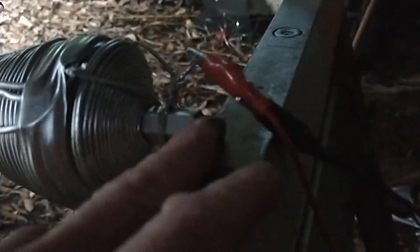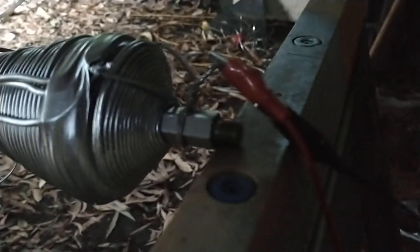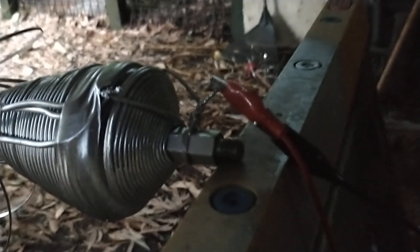This is my old one — I've made a new one for the car now, a better one. But this one's now going through another coil system that just kind of excites things a little bit, and then that goes straight up to the antenna. This is very different than the previous one. This one is fed with a single wire, so it'll literally just screw on like any other whip — just one point of connection. Whereas my other E-field antenna on the car has to have two connections: the ground and the active.